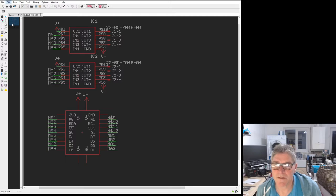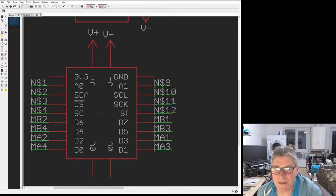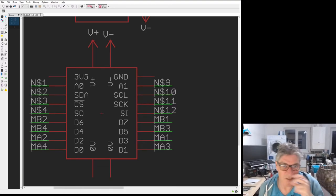The other thing we need to do here is, I don't need the V++ yet. Let me just go through these signals again. So we've got the FPGA signals, which we've already used. So every tile has 8 bidirectional, generic FPGA I/O pins. Similar, really, to a PMOD in that sense, a double PMOD, where you'd have 2 rows of 4. You've got similar capability as you would on something like a PMOD.